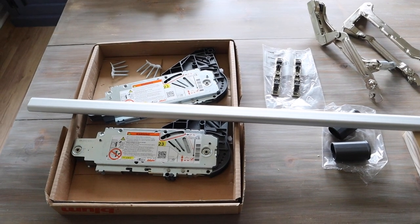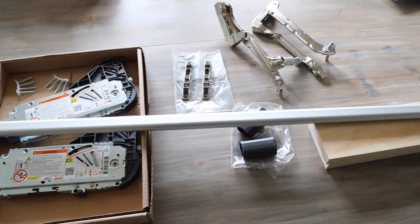The next really important piece for an appliance garage is having the right hinges. I did a lot of research on finding the right kind of hinge and found one made by Blum — it's called the Aventus HL line. I'll link below where I found these hinges. I found a few other options on Amazon which were less expensive, but they didn't look like they functioned as well and the reviews weren't as good. I think Blum is the way to go — it's known to be a quality hinge.